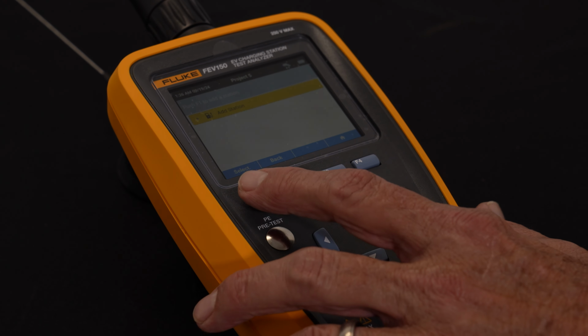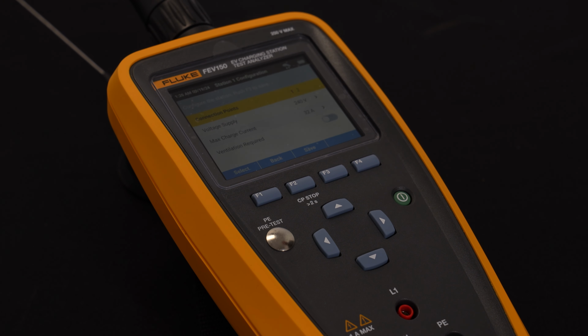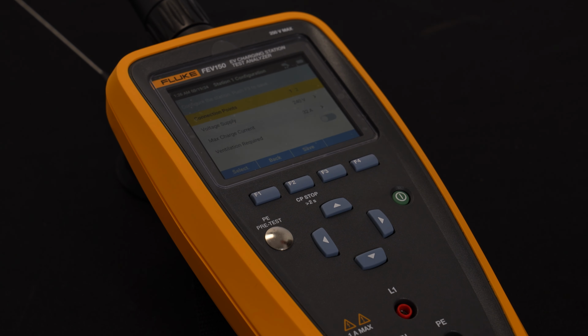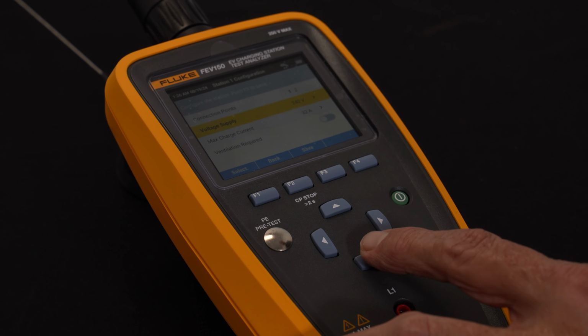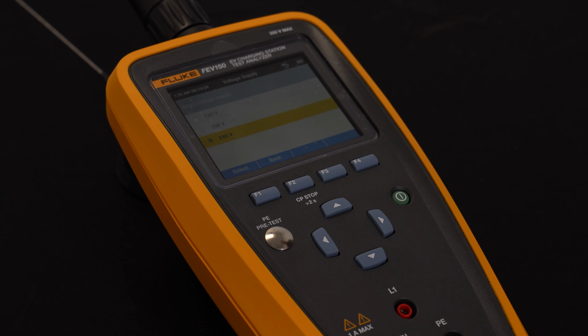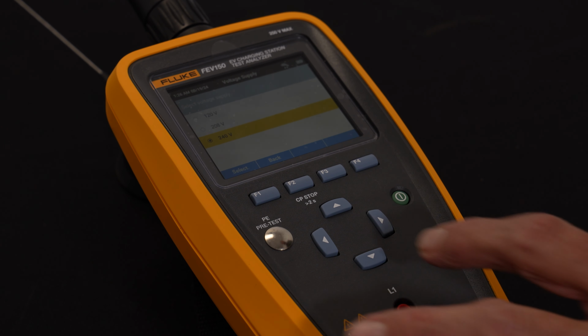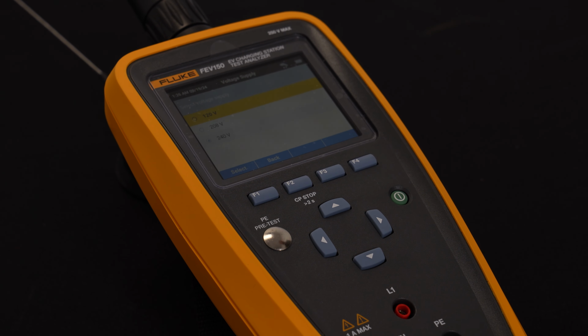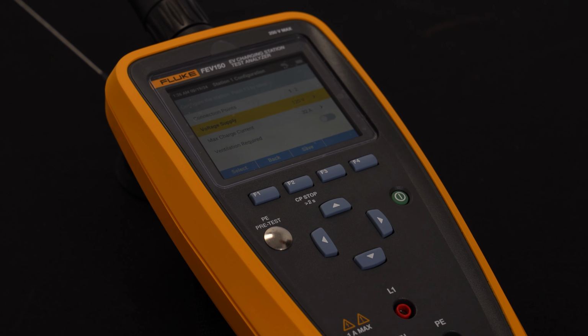We'll bring up the first one here, and we're adding a station. What we're doing here is we're going to try to figure out are we testing one or two connection points? For simplicity's sake, we'll leave it as 1 point. I'm going to come down to the voltage supply. We're going to hit select, and the choice is the power of this EV charging station: 120 volts, 208, or 240. For demonstration purposes today, I have it hooked up to an EV charging station that plugs into the wall at 120, so I'm going to select that.